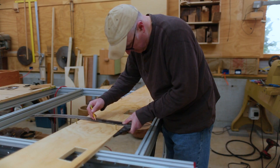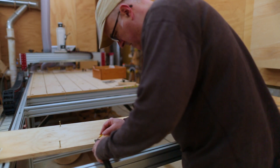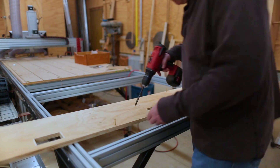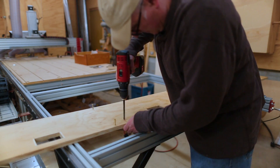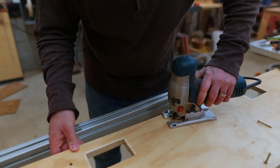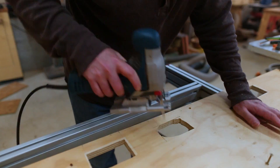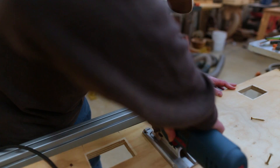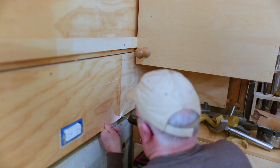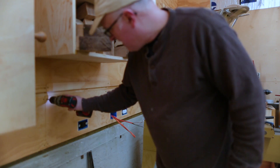Now I need to put the panel back on the wall. I've added the junction box for the lathe and a new outlet, so I needed to cut two new holes in this panel. I drew where they go, then drilled a hole to start the jigsaw and cut out the rectangle with the jigsaw. It actually fit on the first try, which is rare. So I can put it back on and just screw it back into place, and it's a lot easier than digging through drywall.